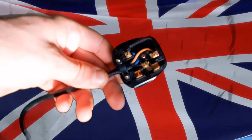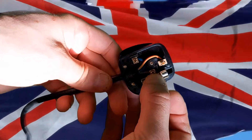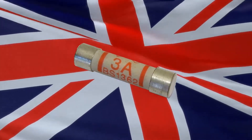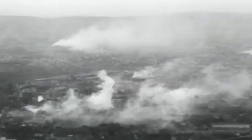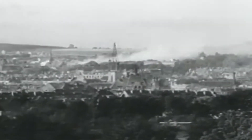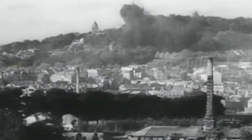Whilst we're looking at the plug itself, it's worth mentioning that it's pretty much the only one in the world that is fused in the plug. This little ceramic safety feature keeps you safe from too much current going through the cable, which would cause it to catch fire. This is because after World War II there was a copper shortage, and so to save copper, they decided to put a fuse in every appliance's plug and wire the house as one big circuit, rather than having lots of runs of cable going out to each socket and a separate fuse on each.